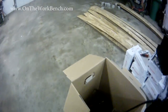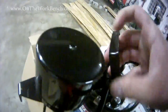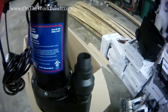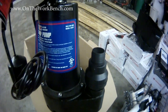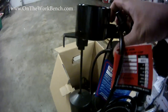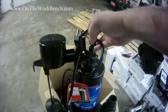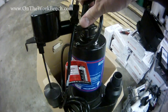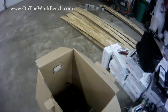Now we've got our main sump pump. This runs on AC power. This is a half horsepower sump pump. There's actually an extra check valve here to make sure that the backflow pressure on the pipe stays off the pump to keep it operational. We've got our float switch and our submersible power cord. It comes with a nice handle on top. Now you can get pumps in a variety of colors, but you're generally not going to be looking at your submersible sump pump.